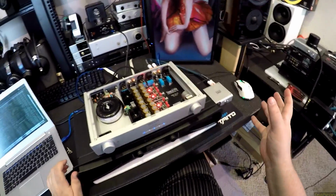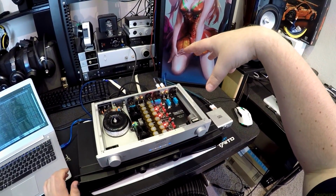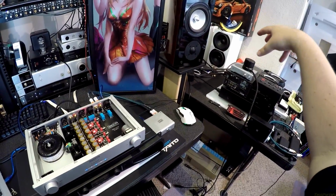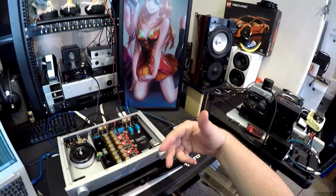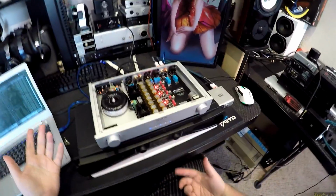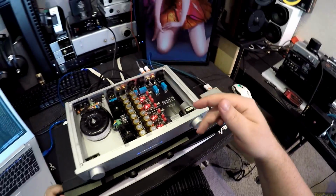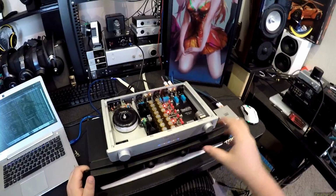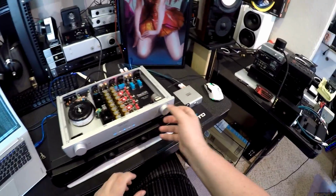Now that we've discussed that, what is this doing? Well, an active preamp can take the signal you're getting, make it higher than it could have ever been through a passive, and then feed it out. That's what the high-low gain is for. Now I have it set to low, and I think I like the way that works best with this, because this you set, you know, what's the maximum, and then you have to adjust.